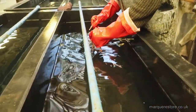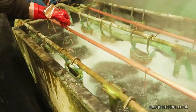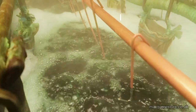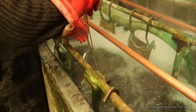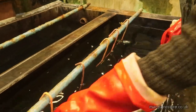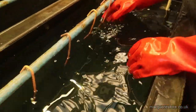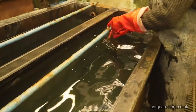It's almost a shame we're going to carry on, but back through the rinse system and then back into the nickel tank as we did before. This time we're putting a much thicker deposit of nickel on — the first coat was what's called a strike coat, where you just put a small amount on. Now we're out of the nickel. The good looks and weather protection come from the nickel layer; think of the copper as a high-build primer. The only reason we put a strike coat of nickel on beforehand is that you can't plate steel directly with acid copper.